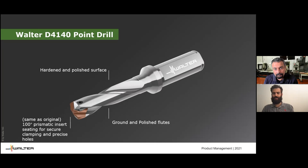Typically you have a certain way to hold these using adapters — whether it's a machining center or a lathe. Hydraulic holders or shrink fit holders are common, and on a lathe there's a specific way to hold them. We also have some with CAPTO connections. There are feeds and speeds to consider, and you usually need true through-coolant systems for these drills because chips absolutely need to get out. Other than that, it works like any other drill.